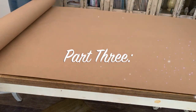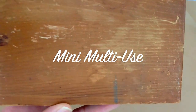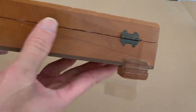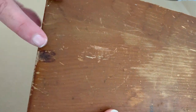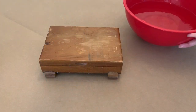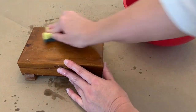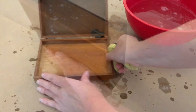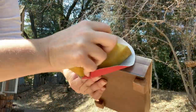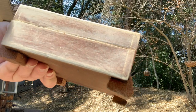Our third project is a true mini, and also probably the best one if you are a true beginner. I picked up this vintage-ish cigar slash jewelry trinket box in a local antique shop near Meg's house while we were on vacation for about five bucks. It's mostly wood, with just its bottom being made of some kind of pressed board. You can see it's pretty scuffed and dirty. I gave it a good spray of Simple Green, then used hot water and a sponge to scrub it clean. Even the small pieces can carry a lot of dirt! Then I set the little box out in the sun to dry, got out my sanding sponge and a 220-grit disc, and gave it a good scuff sand to dull the surface so the paint can adhere better.